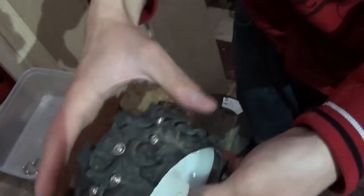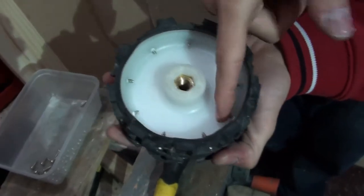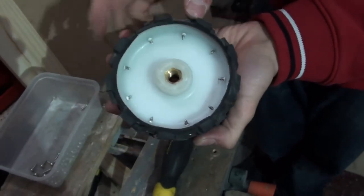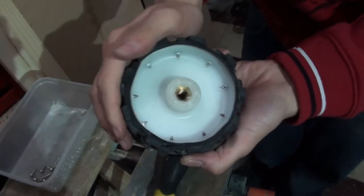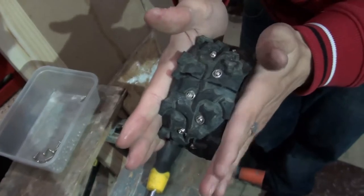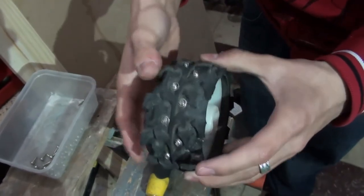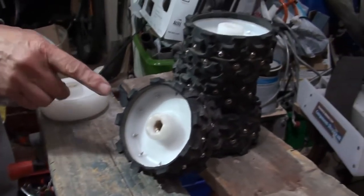You can see we've just finally trimmed the rubber off so that the join is even. We've left the tips of the screws inside — we'd prefer to cut them off but it's awkward. We can't get anything in there big enough to snip them, and we're reluctant to undo these threads, cut them short and put them back in again because it just seems more trouble than it's worth. They're really not a safety hazard, and on our robot they're completely concealed anyway. We've got the chassis and the armour of the robot, which is why we've made them this wide — five centimetre wide tread fits really nicely in our machine. And so now we have a complete set, from this original nylon wheel to our set of robot wheels.